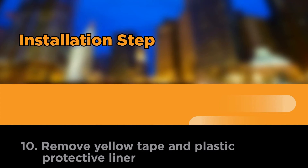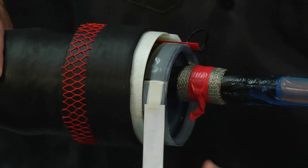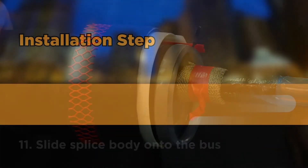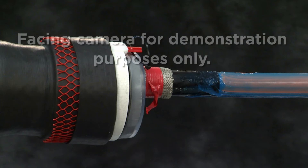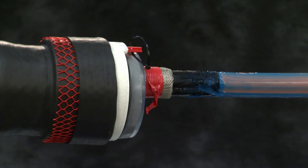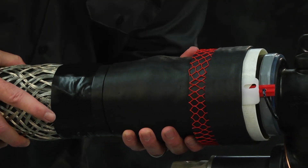Remove the yellow tape and plastic protective liner to expose the gray mastic on the lip of the joint body. Notice: do not remove the red tab at this time. Slide the splice body onto the bus. Position the splice body with the red release tab lined up on the side of the bus facing the installer. Slide the splice body firmly onto the bus so that the lip of the joint body clear portion overlaps the shoulder of the bus and is firmly butted up against the bus shoulder.